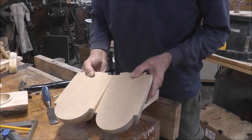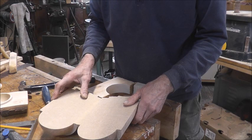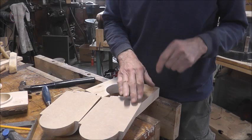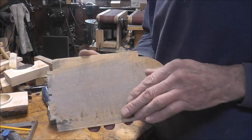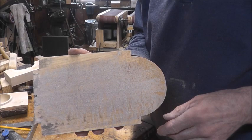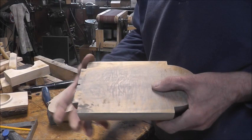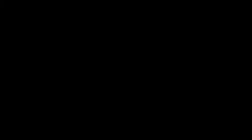Now what I'm going to do is clean some of this off with the belt sander. Actually, we wouldn't really have to — it should be okay the way it is, because we're going to lathe this off anyway. I'll just see if I can clean this off just a little bit. Putting it on the belt sander just took some of the brownness off — but really not necessary. Okay, what I'm going to do now is cut this dovetail right off on the saw, and then we'll do a little bit of layout work and be ready for the next step.